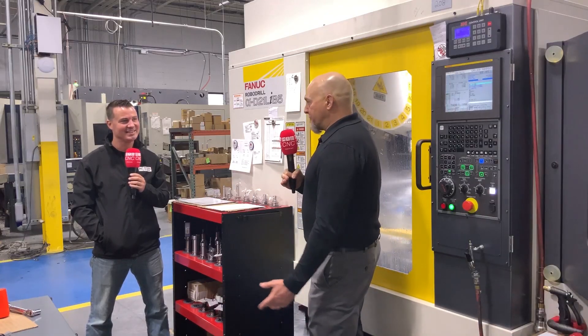With the Kiwas and the pallet machines we have zero downtime on the spindle. Those machines were running three to six hours at night unmanned because of the number of pallets and parts. With the RoboDrills, we've cut cycle times down so well that we'll get about 15 minutes of unmanned time, but we'll get twice as many pieces done in a day.